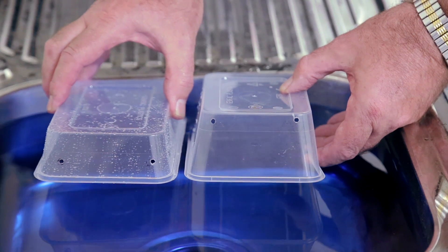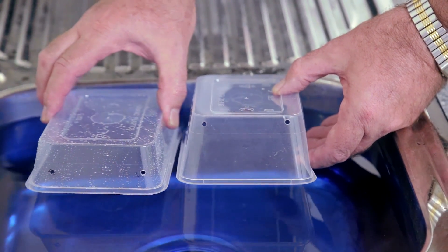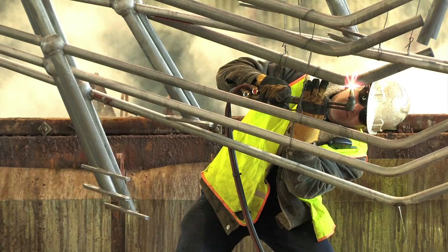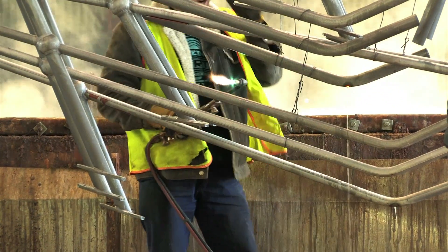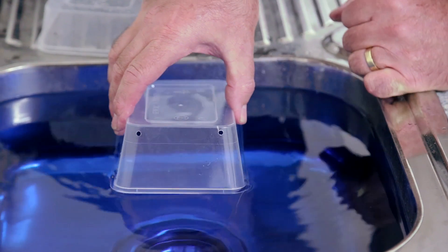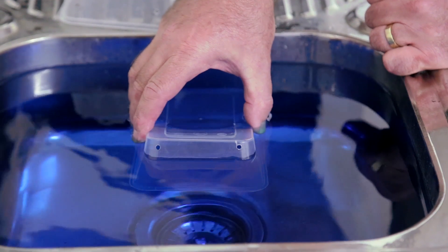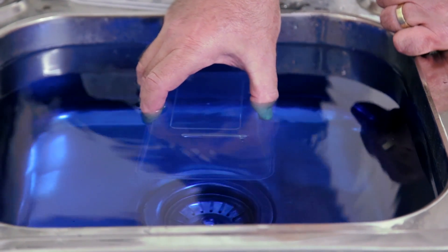It's always better to put the holes as close to the surface as possible to allow for as much air to come out as reasonably possible. We understand that engineers don't like people drilling holes close to their welds because it has an effect on the integrity of their product. However, from a galvanizing perspective, it's important that we get the air out so we can guarantee a good quality product. And I'm going to show now that we have a much smaller bubble in the top, which would lead to a much smaller miss in a galvanized item when the holes are at the top.